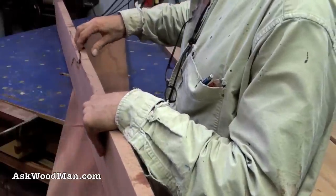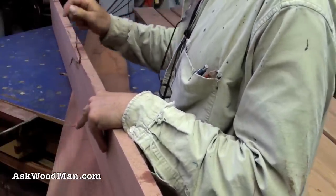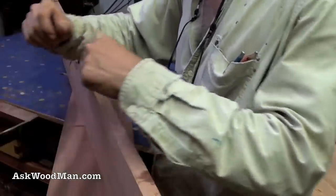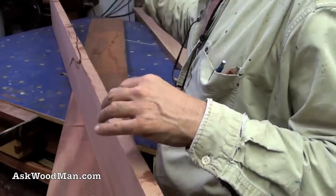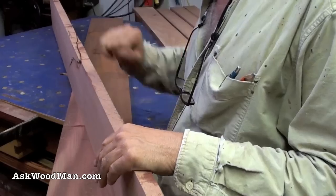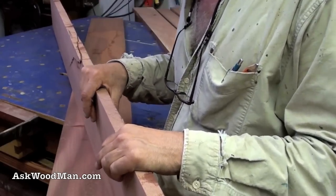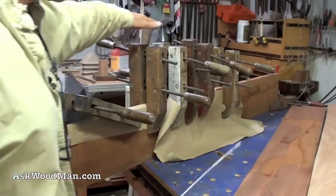What I'm going to do is take a screwdriver or chisel and drive it into the crack to open it up. What I like to use are old strips from windshield wiper blades — the thin metal is really great for getting glue down into cracks like this. I'm just going to get as much glue in as I can, make as big a mess as possible, and then clamp it up. Tomorrow morning it'll all just get cut off with the jointer or planer.